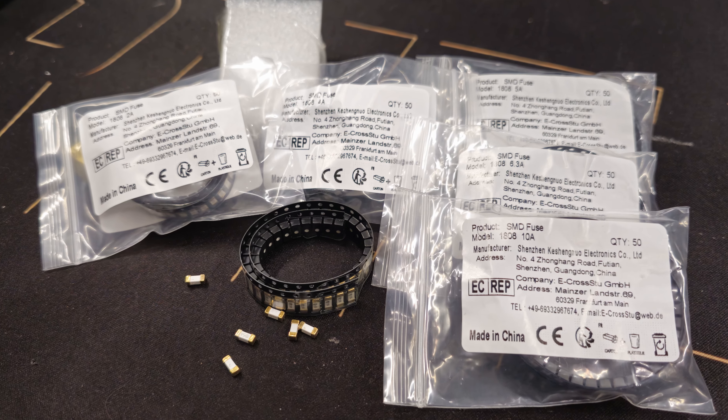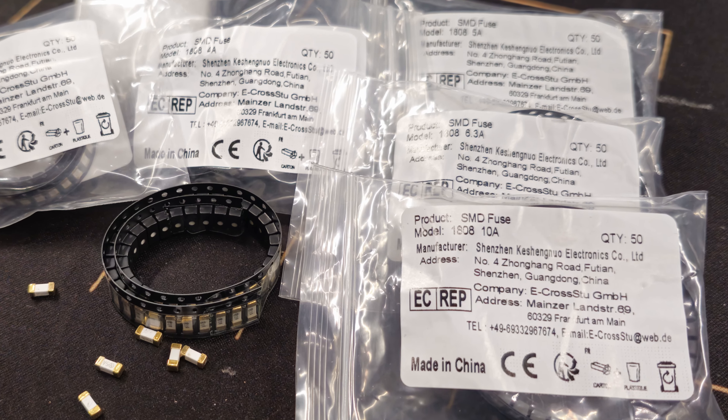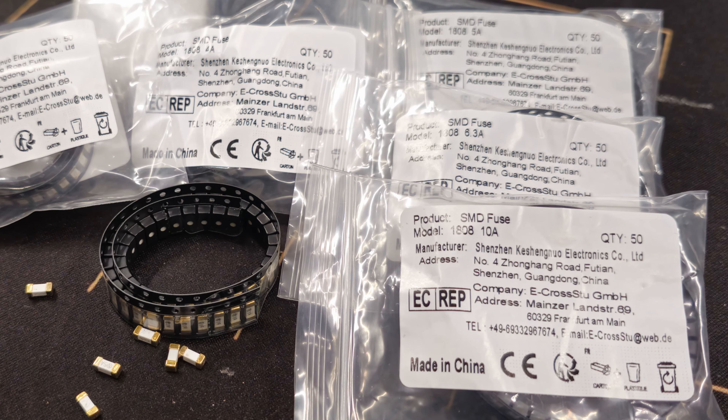That's also why I don't include auto-reset fuses on the outputs — it's very hard for me to predict what size fuse is actually appropriate for what you're going to connect. Do you need 5, 1, 10, 1.5 amp? Are you connecting 22 gauge or 12 gauge? I can't know. I will have a link in the video description where you can stock up on spare fuses of various sizes — they cost about $2.50 for 10 on AliExpress, so you can easily get a few different variants in stock. As I mentioned, all my 48 volt supporting products will use this type of fuse, so it's good to stock up.